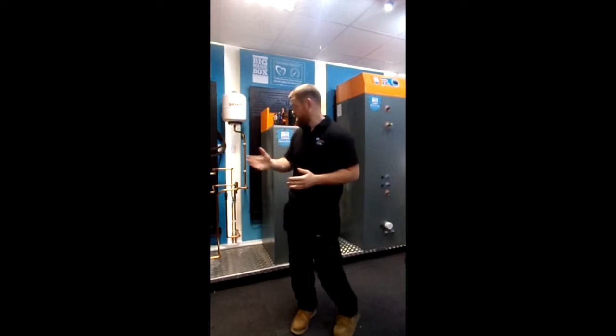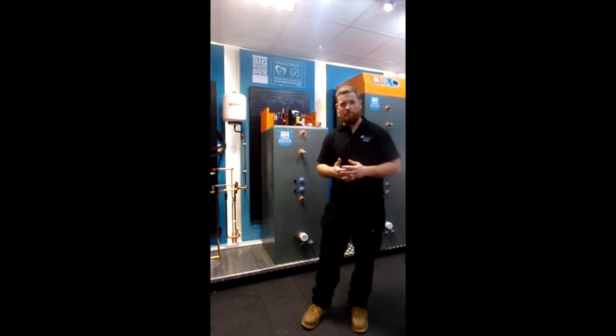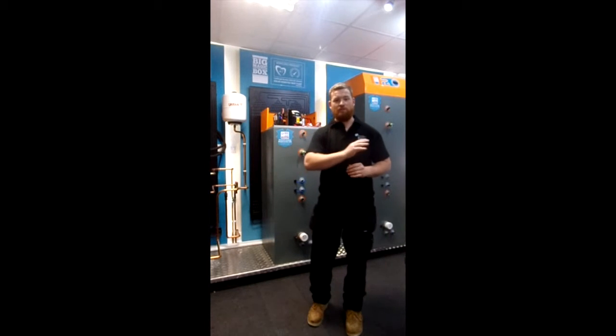Hey, I often get asked what is a solar assisted heat pump. Now, our thermodynamic solar assisted heat pump, which you can see here before you, can best be described as a fridge in reverse. Most people understand that the panel on the back of their fridge is a factor in keeping its contents cold. By reversing this principle, using the aluminium evaporator you see behind our products here, we're absorbing heat as opposed to rejecting it, and using the heat that we capture to heat hot water, providing you and your family hot water in all weather conditions all year round.